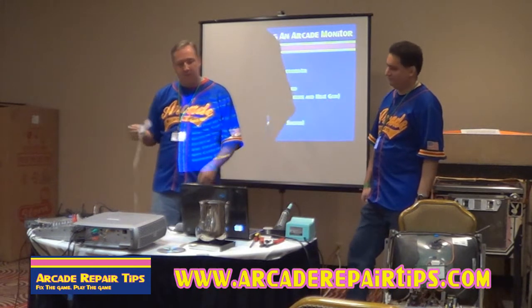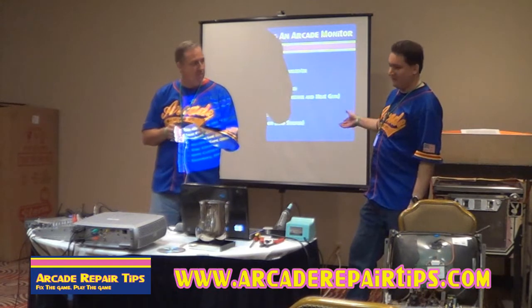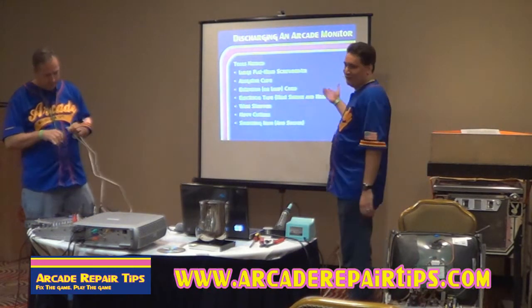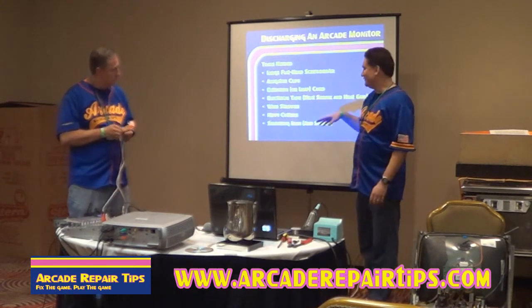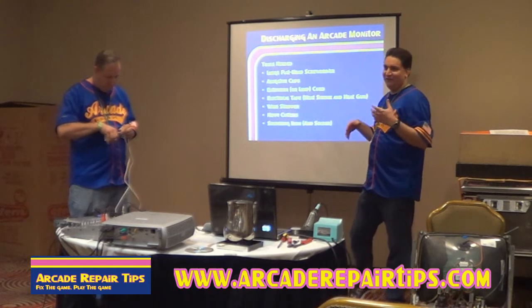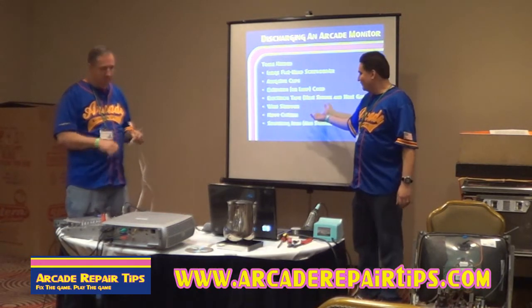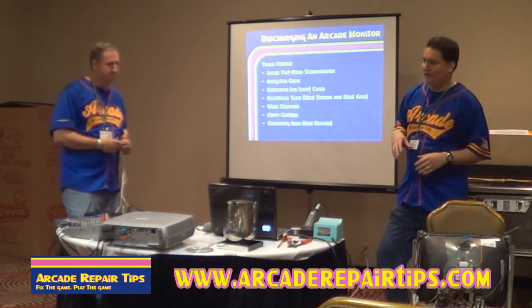So what we're going to do then is take the ends here. While you're doing that, I'm going to explain to everybody what they need, as far as tools go. Of course, you'll need a large flathead screwdriver, and we'll show you what that does in a second. You'll need some alligator clips. You'll need an extension or lamp cord, which is what Tim has right now. You'll need electrical tape. You can also use heat shrink or a heat gun. That's up to you if you're really anal retentive about how it looks. I usually use electrical tape. It's not that big a deal. We have wire strippers, of course, nippy cutters, and then a soldering iron and some solder. You do have to have at least some soldering skill in order to do this.